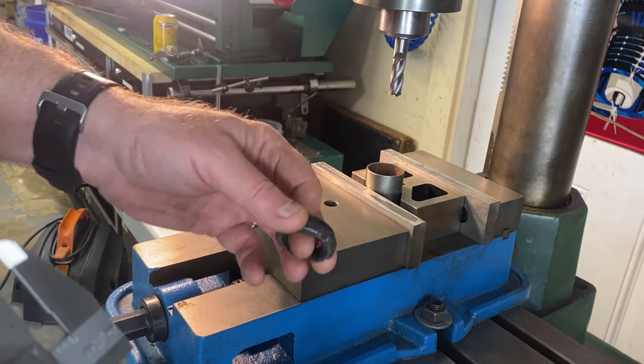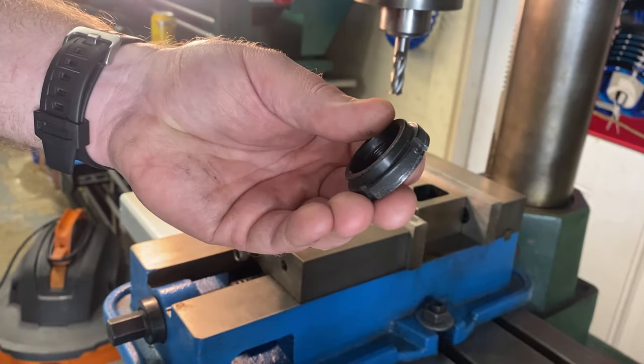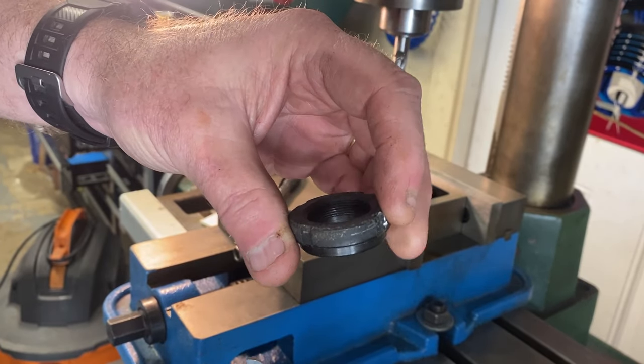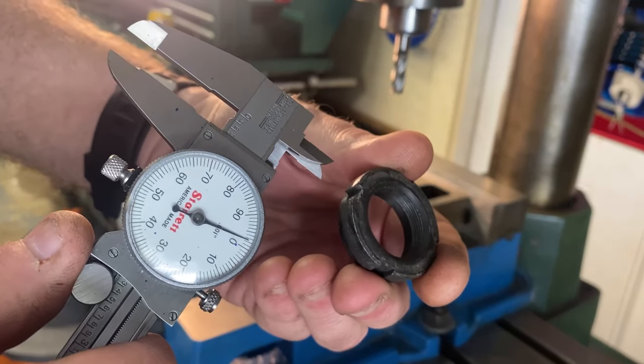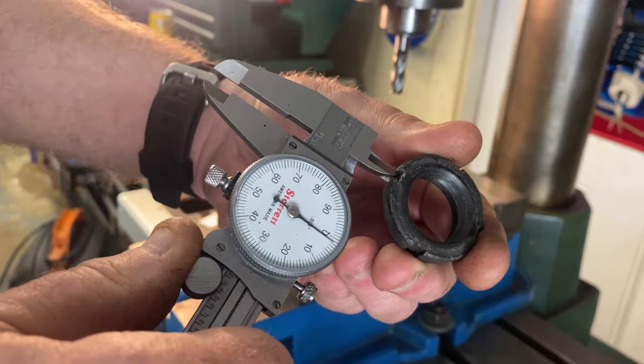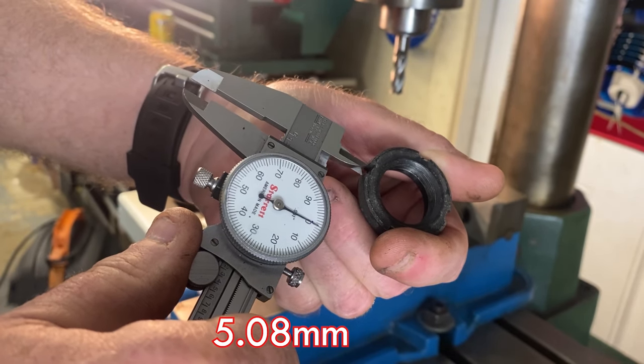Let's do that. I'm gonna use a half inch roughing mill to make the cuts. It's not going to the moon, doesn't have to be perfect. Just need to make relief so we have the tangs left over for this. Speaking of the slots for those tangs, let's see what the width of those are. Each of those is 200 thou imperial, of course. And double check another one.